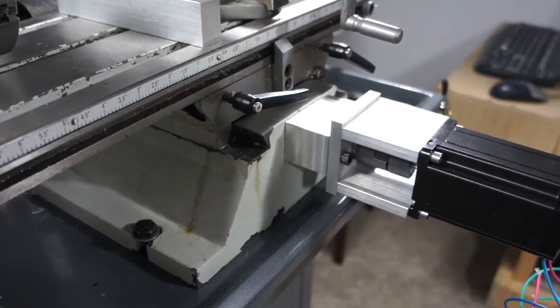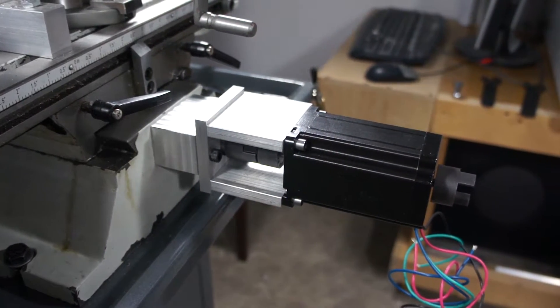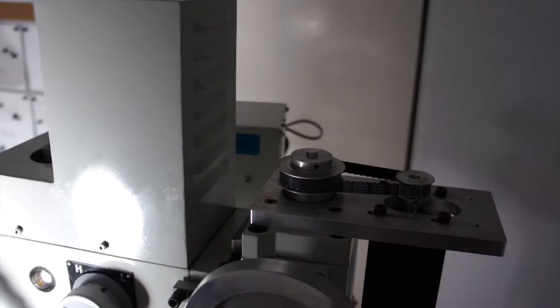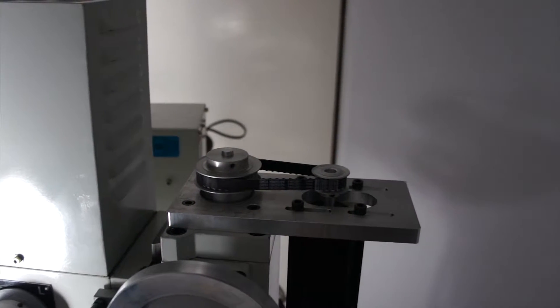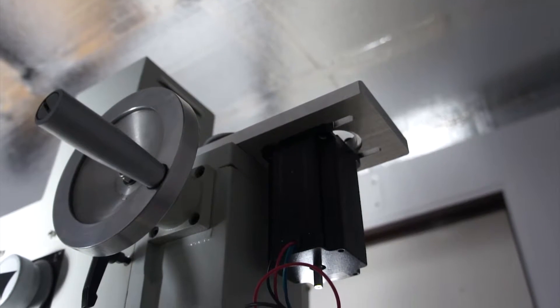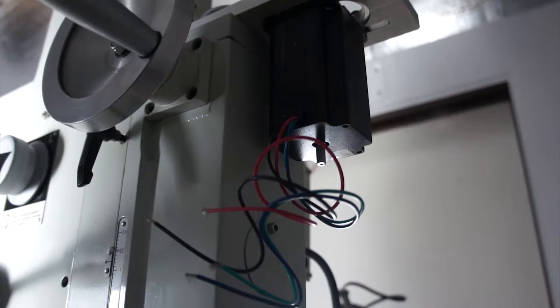The first axis I started with was the y-axis, just because it was more difficult and I figured I'd get that one out of the way. Then here is the z-axis all mounted up. Once again these were pulleys that I ordered last week — they came in, had to modify them slightly but everything seemed to work out. My belt was a little bit short so I had to move the stepper mount a little more forward, which means putting the part back on the CNC, but in the end it functions great.